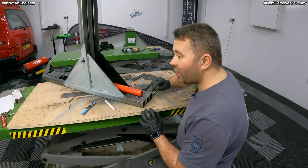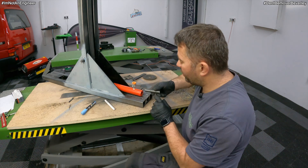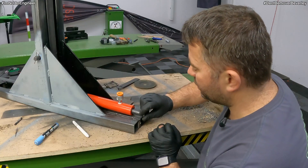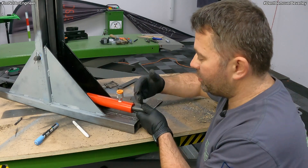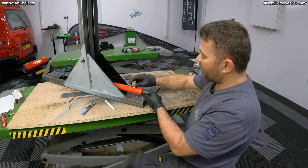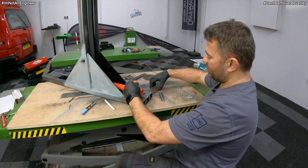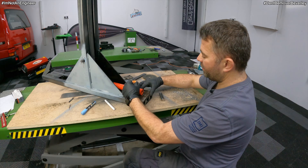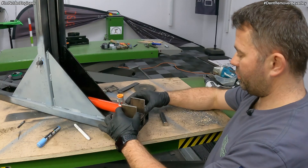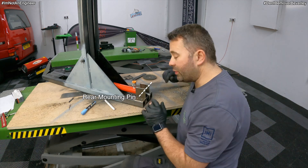It's looking really good so far and I'm really happy with it. What I need to do now is support the rear with the portapower. Like before, we've got the male adapter — the male end — that's going to go in like that, and that will support the power so when it's pushing the arm it can't go any further back. I need to put some brackets on there but this is a little bit uneven, so I've made a plate with some holes in. I'm going to plug weld those, and then we've got the two brackets like that — that goes in, and then that's the portapower side all done.